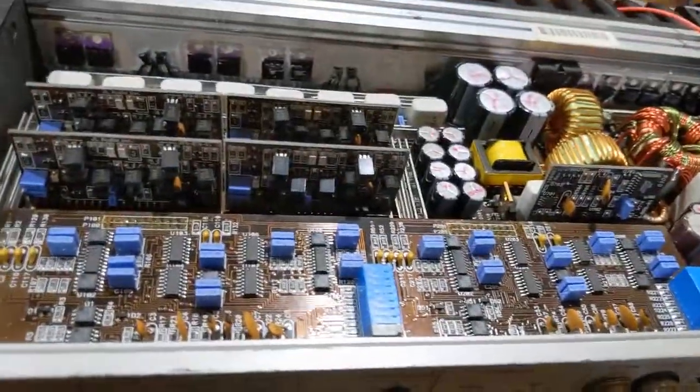Now it's time for the sound test. I went ahead and set everything up for all-pass, no filtering, none of that stuff for right now. The speaker is hooked up to the channel that was blown, which was the left rear. I have it set for two-channel mode so I don't have to have four RCAs. I'm missing the hardware, so there's not much I can do about that unless these are off-the-shelf. I have the terminals now tightened in. Let's go ahead and plug it in. We're still good, we're still lighting up. Let's watch the current draw — remember this is times two because there's two power supplies in parallel. I'll let this idle for a minute and then do a sound check. My inputs are now in there. My idle current is jumping up a little bit, probably because the transistors are getting hot. I did put some new thermal compound on there.